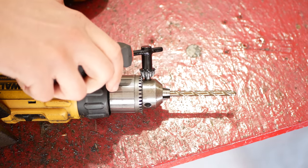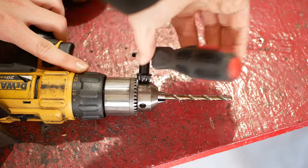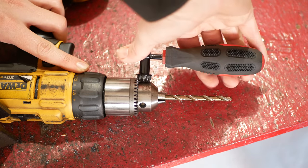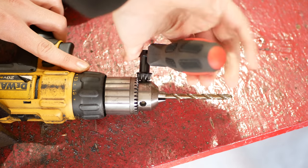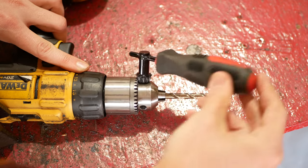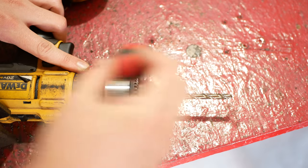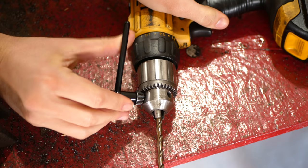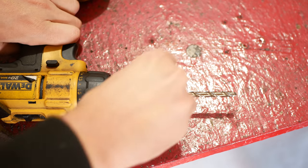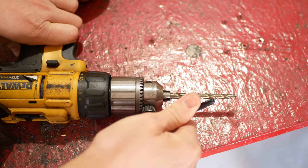Feel-wise, it's actually kind of nice — it's a little bit like using a torque wrench, and you can kind of get a hang of where that bending feeling comes in, which should help keep me from the desire to over-tighten the chuck. I've used each of the keys at least a couple of times, but the one with the screwdriver handle is my new go-to. If I had to go on a critical job and needed to be a hundred percent sure that the chuck key wasn't going to break, or I needed something a little bit smaller, the one with the bolt handle would be the way to go. But for comfort and ease of use I've been very happy with the screwdriver handle key.